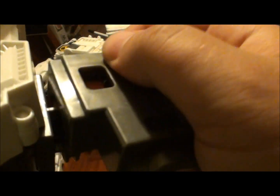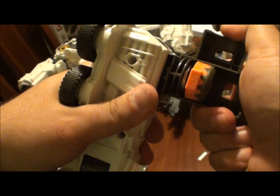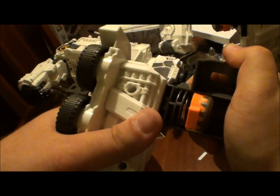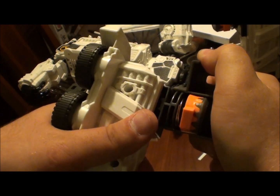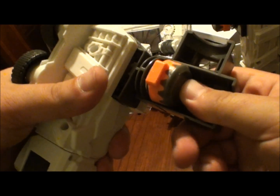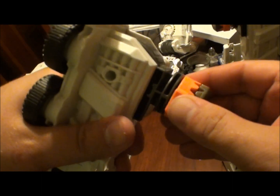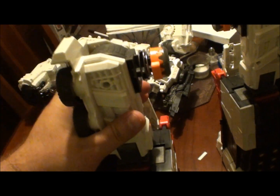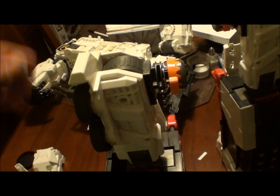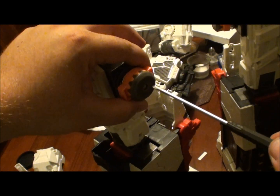So, these orange pieces here kind of plug in to these holes. And as we turn, you can see that it separates and then it slips basically. So, putting anything here is not going to solve any problems. We need to get more tension on this spring that is pushing against here. So we're probably going to end up taking our other 2 flat washers, our nylon ones here, dremeling them out and putting them in. But these work differently.